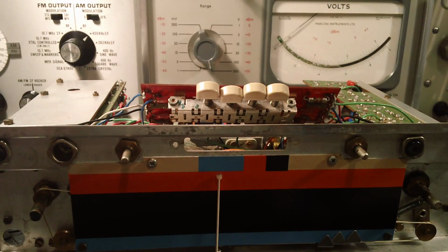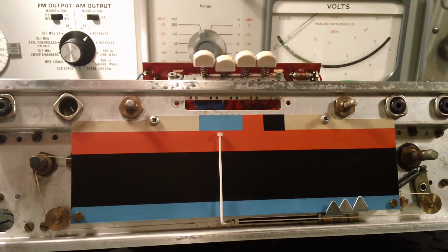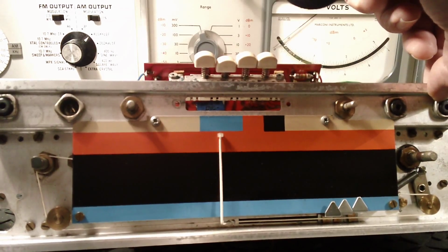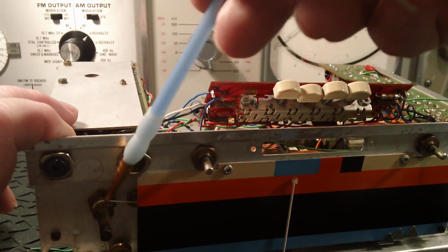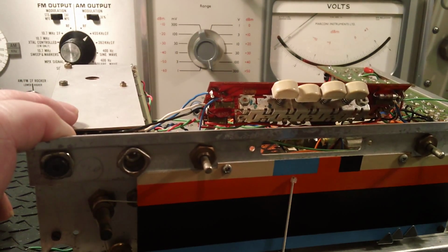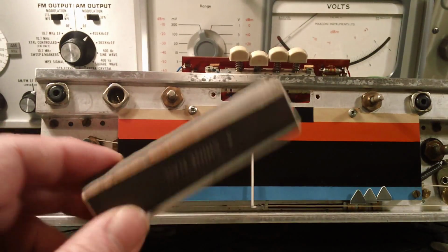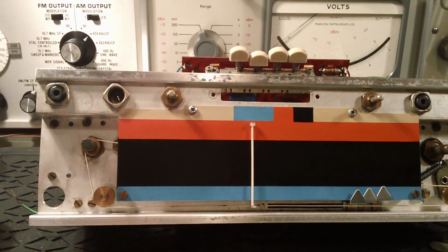The next thing to do is get a little bit heavier, and what I'm going to do is I'm going to get a little cordless drill thing, although mine's actually got a cord, so it's a fully corded drill, with a wire brush, and just gently clean the corrosion off these switch sockets here. I'm also going to clean the shafts on the pots, because this one's gone green and that one doesn't look much better. What I've also done is I've gently sanded using like a lady's nail board sander the parts on the chassis here where the scale plate is going to sit.